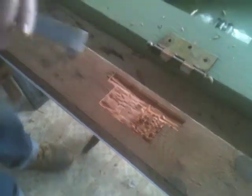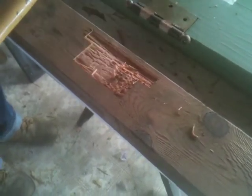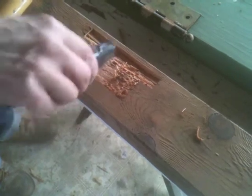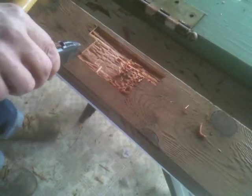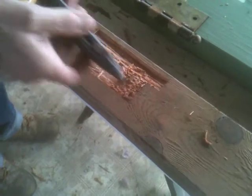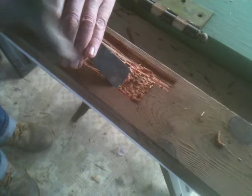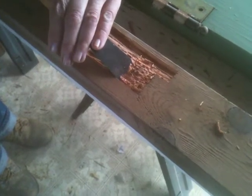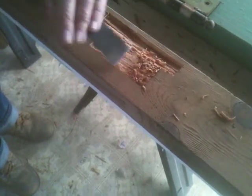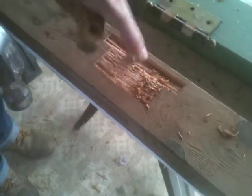But mostly it goes like this. Basically, what I did was I took a utility knife and cut a whole series of incisions in one direction, then in the other direction. And as a result, the wood fibers will flake off if you apply some pressure to them. That's how we carve out a void for the hinge plate and the hinge post.